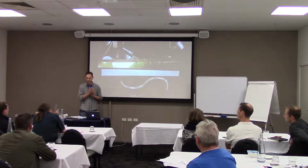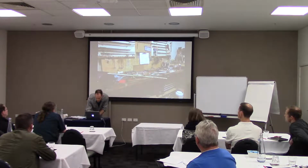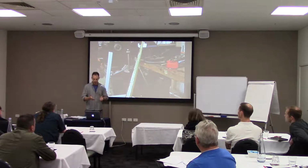So what would be the next step? Do you have that cut out of brass and then you fold it over? I do, especially with a small diameter. Well, you don't have to have a taper. I use a long trombone mandrel or a straight mandrel, and I'll cave it over just at the end. I just hammer it over, and it lines up nice. Once it's annealed, it really lines up. It's like, wow, this is cool. You do it, you guys will love it.